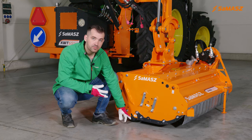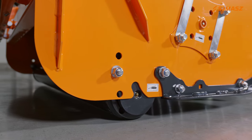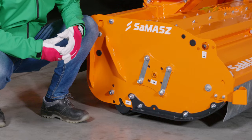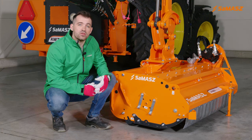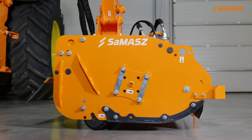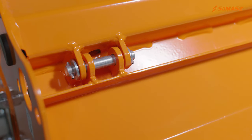This is a ground following bar. It should go on the ground while mowing and is used to adjust the mowing height. The holes located here are used to change that height. Remember, a properly adjusted machine runs on a ground following bar when the sliding skid goes just off the ground. It is worth mentioning that the LAMA HD has an adjustable front flap, which can be used as an inspection access.